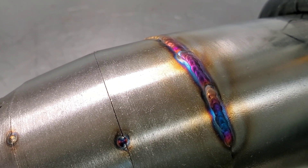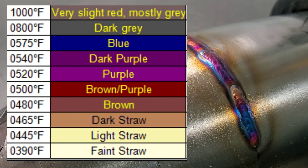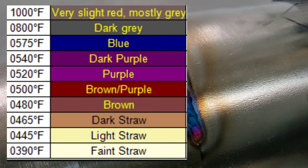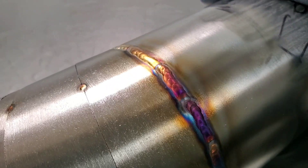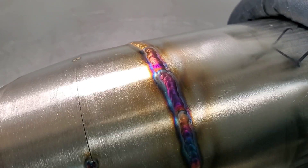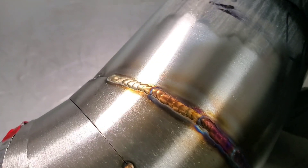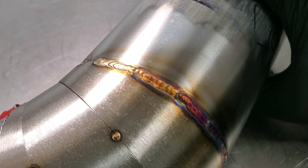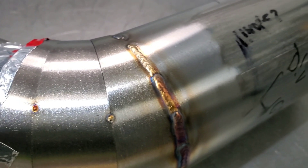Now there's a color chart — I'll add it right here on the right. There's your color chart. These are the colors and the temperatures that the metal, when exposed back to oxygen, causes your stainless steel to turn to these colors. What I try to do is target this purple, violet purple one and the golds right here, in this area, back and forth a little bit. That's what I find to be the most attractive color of welds. You can aim for whatever color you want — I just recommend messing around with the timing and getting a feel for it to see where you can get your coloring at.